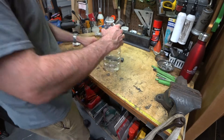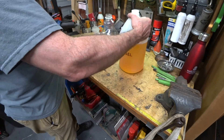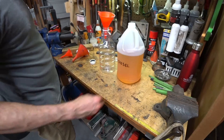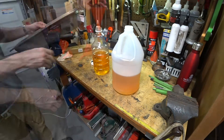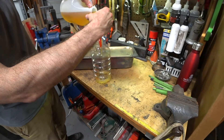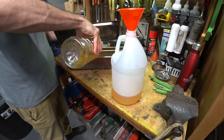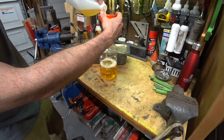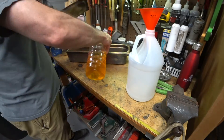The point of this experiment was to see if I could get an optimal hardness in a water-quenched steel using vegetable oil, and if not, could I come up with any kind of homebrew alternatives that worked better without having to pony up the dough to buy something expensive like Parks 50 oil. The initial experiment was to compare 100% vegetable oil versus mixtures of vegetable oil and biodiesel.